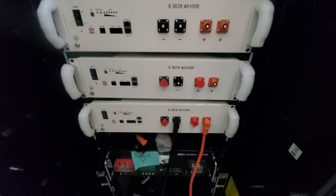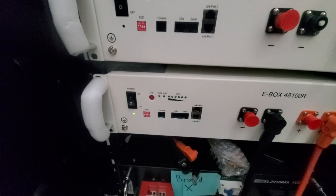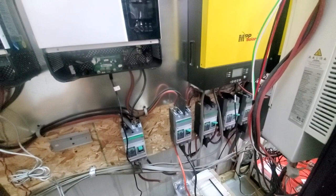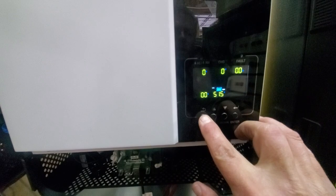We could just simply throw the breaker and power this on without any communication at all. Hit the little switch button — it'll show us the state of charge. I've had this running all night so it's probably very low. Flip the breaker — you'll probably want to use your pre-charge resistor as well. Turn the inverter on. By default, the battery type is set to AGM. Turn the inverter on at the bottom and within a short time it'll put out 120-volt AC. No fuss at all.